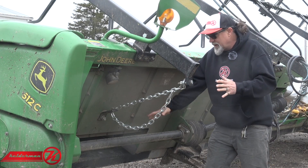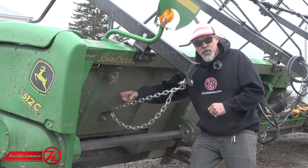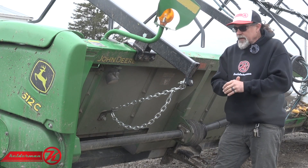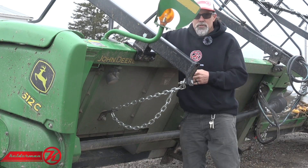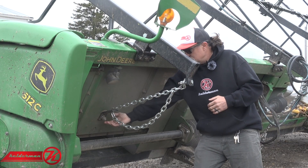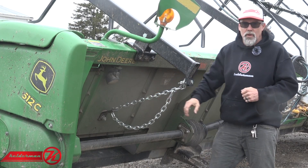The most common question I get is where to mount the chain hanger. We're going to mount this chain hanger on this sheet metal here, about five or six inches up from the bottom. The three-quarter inch bolt has a large flat washer — the flat washer goes on the front side, and then you'll have your nut and lock washer on the backside. Once you sandwich that and get it assembled, it's going to be strong.